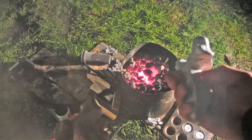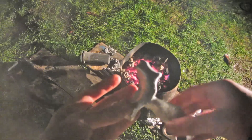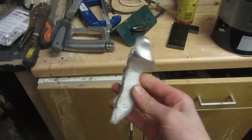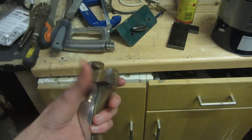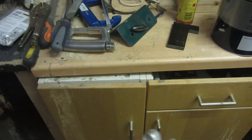After quite a lot of trial and error, this is what the two slingshots came out like. The first smaller one didn't really work because the forks didn't form properly due to surface tension in the aluminium, so that one can be remelted in the future. The second one actually worked really nicely — because I flattened everything out with the spoon it's nice and flat, and it took the shape of the mould very well. There are quite a few finishing steps before getting a raw cast like this into a finished slingshot, but from this stage it's very doable. If you come out with a slingshot looking this good, it's definitely worth persevering — even if it takes a couple of attempts and you have to remelt old castings.